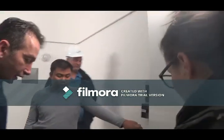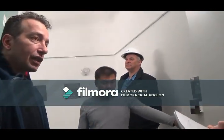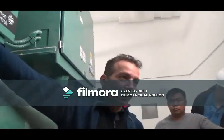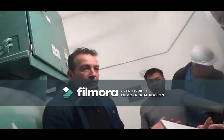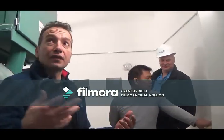That sensor is going to try to sense any refrigerant that's in the room, if there's a leak. And that's just telling you that you can walk into the room. If it says 0 parts per million, that means you can walk in the room and you have clean air to breathe. It's not necessarily going to detect a small leak that's occurring on the other side, because it's not enough to saturate the room with refrigerant. It's getting dissipated. In the event that it does detect a large leak, you'll have your exhaust fan system come on and exhaust the room.